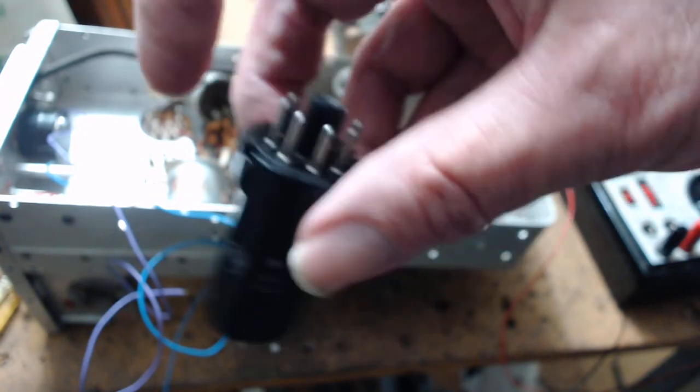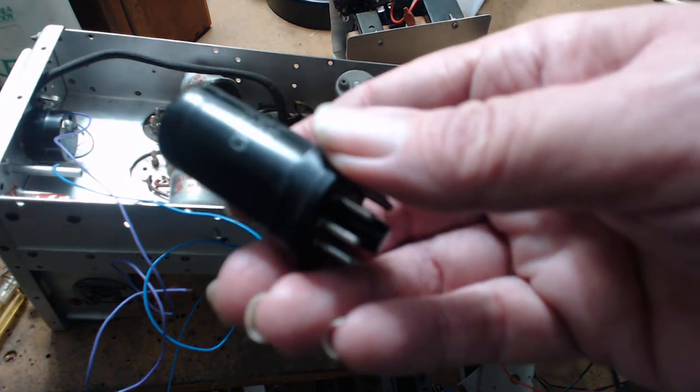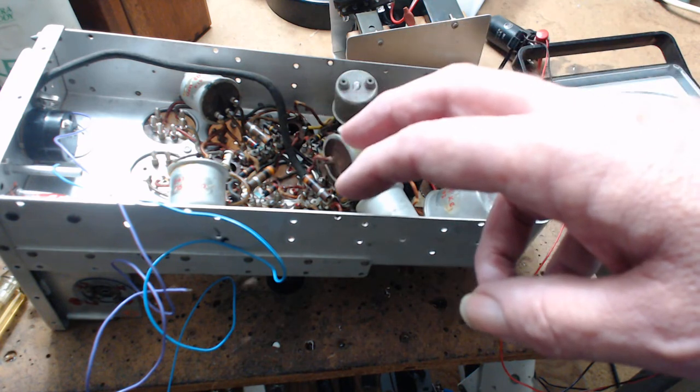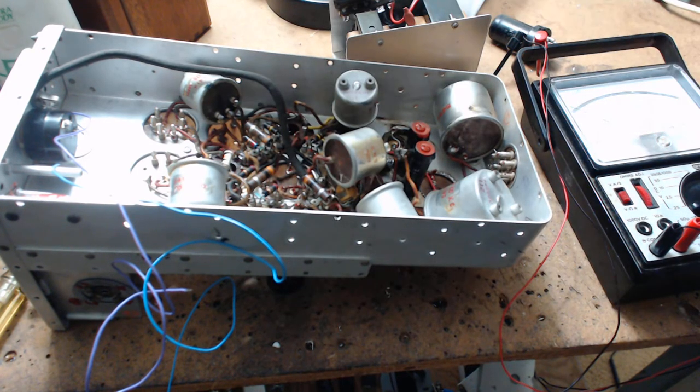The metal tube has a glass tube inside a metal envelope — they very rarely go bad because they're so well made. But this socket says 6SK7, not 12SK7, so I have to watch out. The conversion project has you wire all sockets in parallel and run them with 6 volt tubes — that gets expensive at two dollars each when you need to change six of them. It was a bad approach: all they had to do was change or add a transformer and the whole problem would have gone away. Instead they had you throw away a usable transformer and remove the BFO — it was not well thought out.